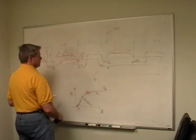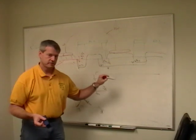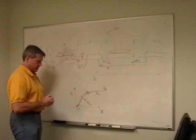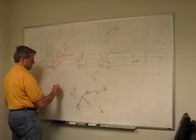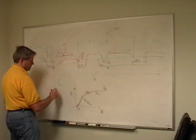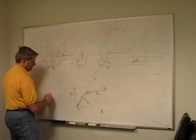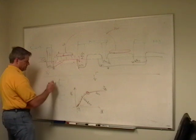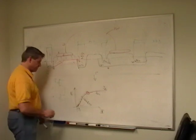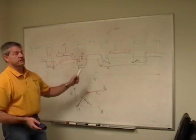So, the first thing you should notice here is that an inverter has two transistors, and if you want to look at it that way, you could say that one way to make an inverter is to use an active load and only drive one of them. So, something like that. And so this is an amplifier. An inverter is an amplifier. So if you want to get really clever in some of your designs, you can turn this into an amplifier.